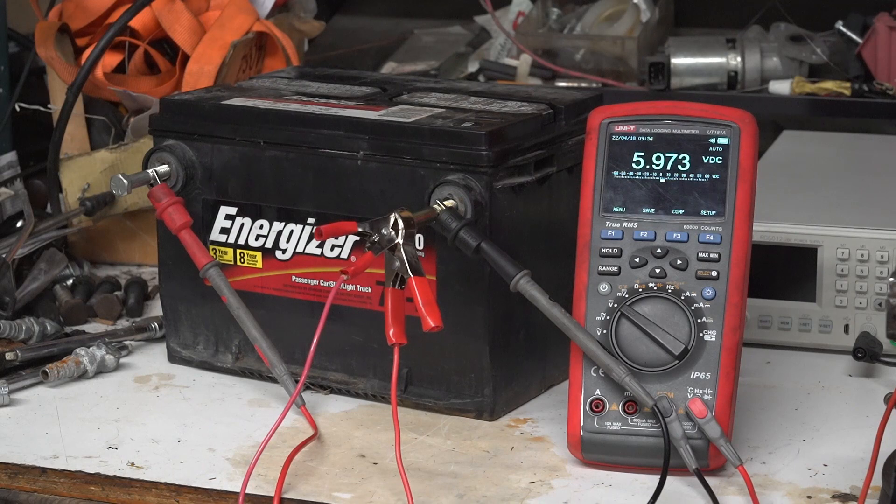If you want to buy one of those welders, buy it with the intent to start welding with it. This is likely a case of getting what you pay for. As for the batteries: I think what caused two of the Energizer batteries to short internally was applying too much heat for too long. You have a better chance of avoiding internal shorts if you don't push to the welder, especially for extended periods — the cells got quite warm and that seemed to be the tipping point. Once cells are internally shorted, I've never heard of anyone reviving that without rebuilding the inside of the battery. My opinion: just go get a new one, unless the battery was working recently and just needs a day or two of charging to come back.